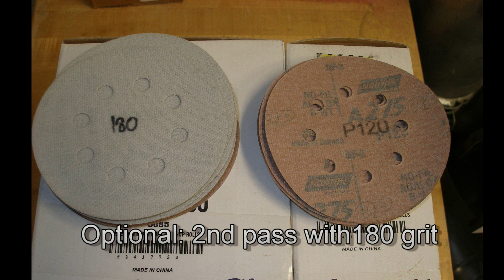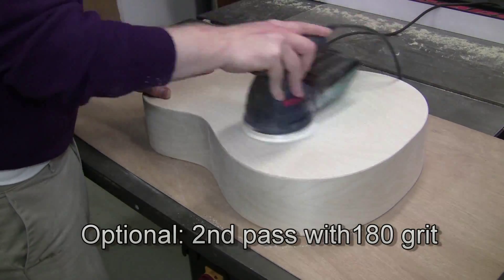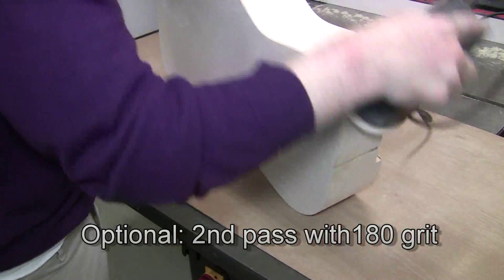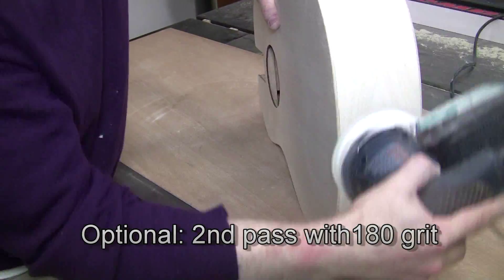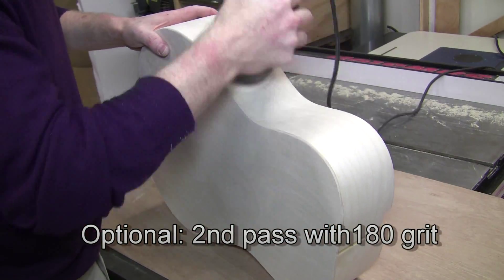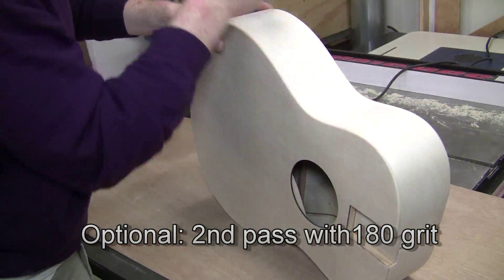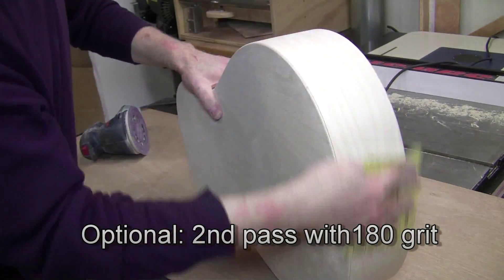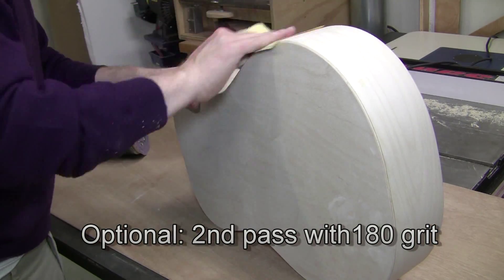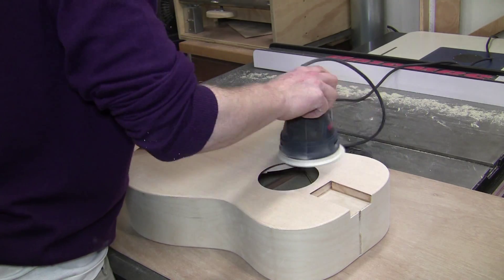Here's what the surface you're looking for — look for scratches. Optionally, you can now switch to 180 grit and sand everything again. This should not take as much work because we're just trying to take the 120 to 180 instead of taking the raw surface to a smooth surface. A second pass at 180 on the siding. On the siding and the waist area, be looking for glue spots — any glue stain on the siding will interfere with shellac wetting it, so make sure those are all removed if you want it to look good.